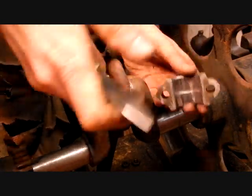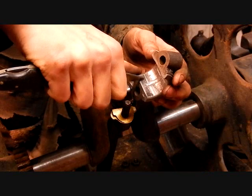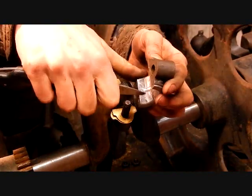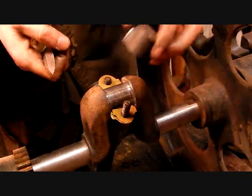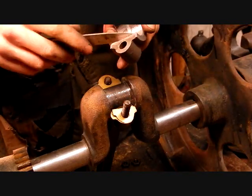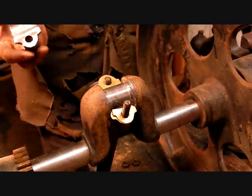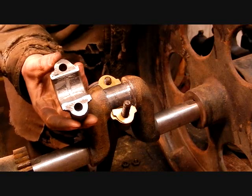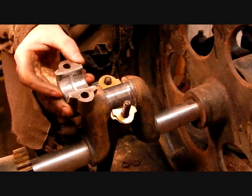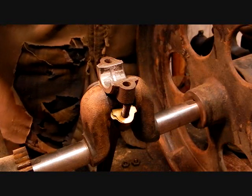The extra time you spend here on the bench fiddling, scraping, tightening, and untightening will pay off in the long run. What I do: scrape away a little bit, put it back on, tighten it down, move the connecting rod, take the cap back off, look for wear spots, and see what it looks like. I'm going to finish it up off camera — that's all there is to it. Leave a comment, leave a suggestion, and as always thanks for watching and come back for more.